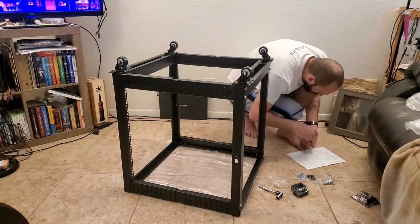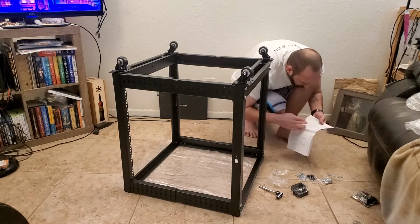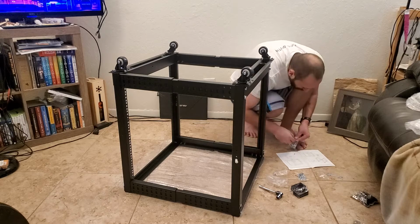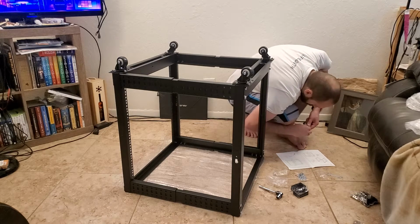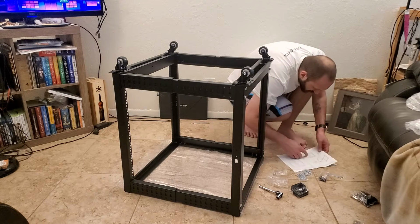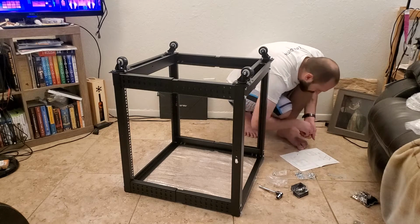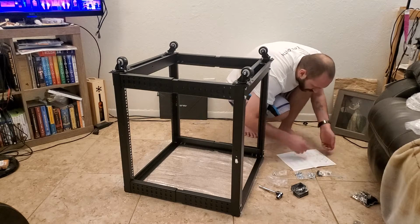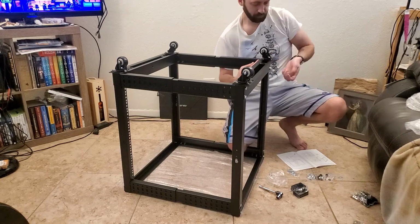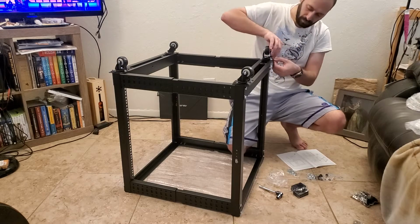Here I'm putting on the wheels, and we'll see me run and get a screwdriver here, and I'll show the head of that screwdriver. Each wheel gets 4 nuts on it, and then in the corner where there isn't that frame that's kind of hanging out in no man's land, it actually gets a bolt that goes through, and that bolt is something that doesn't tighten up. You can imagine if you just hold it with your fingers and try to tighten it with a bolt nut, it doesn't tighten up extremely tight. It'll end up just spinning when the socket's spinning the nut.